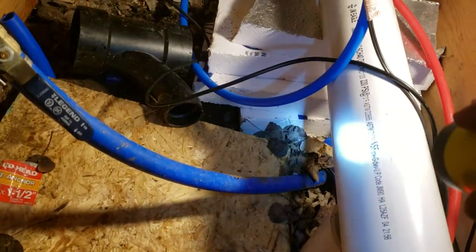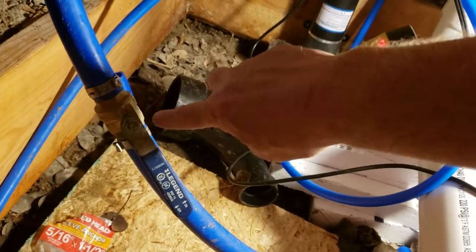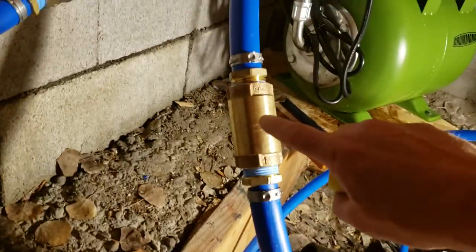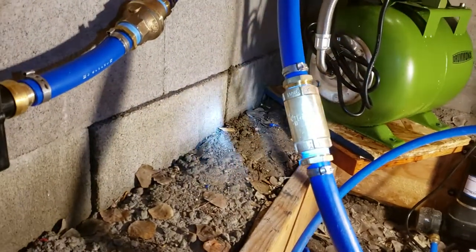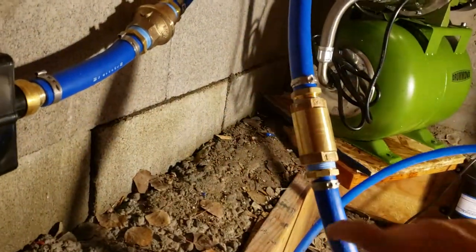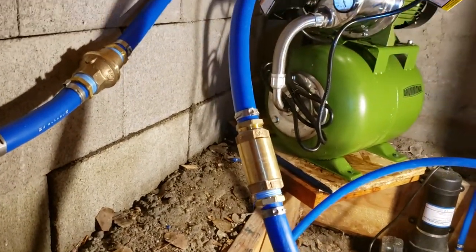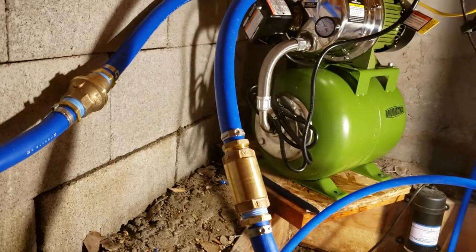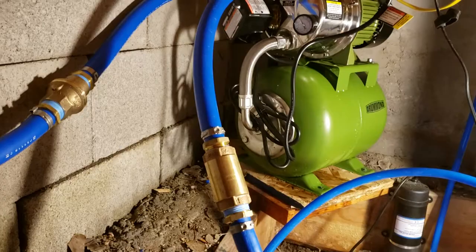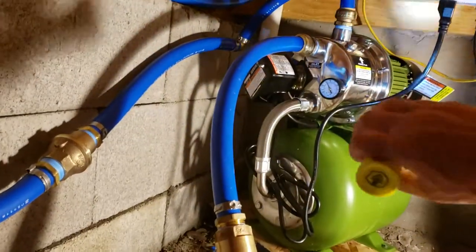The water comes in from a 1,200 gallon water tank that's buried, and that has a one inch line coming out. This one inch line comes out here and I have a valve shut off here. This is the most important part — you can buy these for about $27 at a hardware store — it's a one-way check valve. The flow will come up into the pump but not come back, and that's what helps you maintain pressure. I didn't know that. I fought with it for about a week and a half. The thing would just kick on and off and surge, and it was because the water was wanting to push back into the tank after the pressure would build.